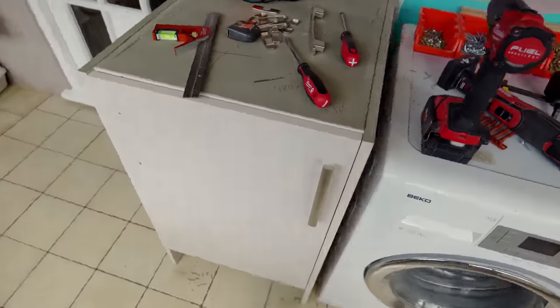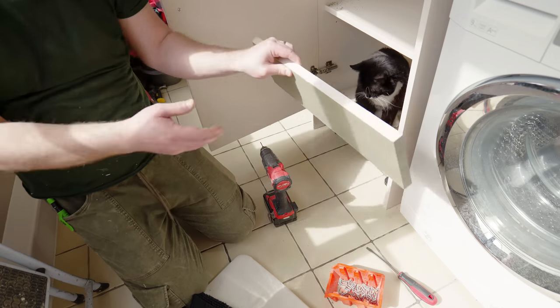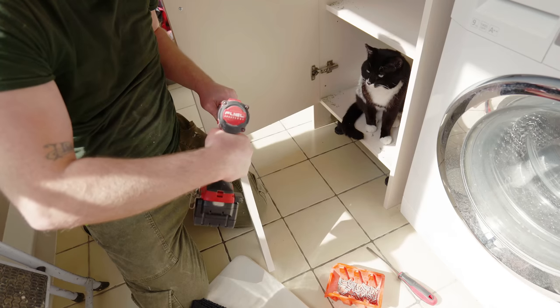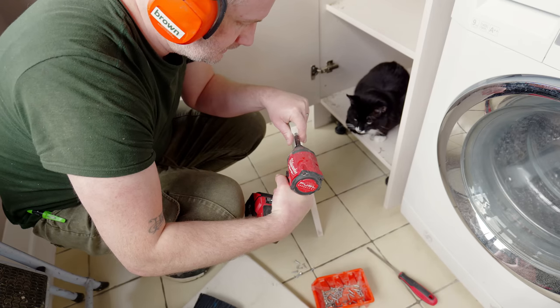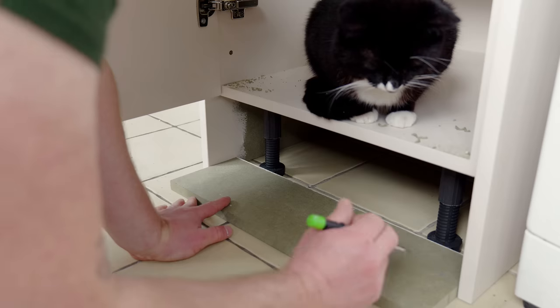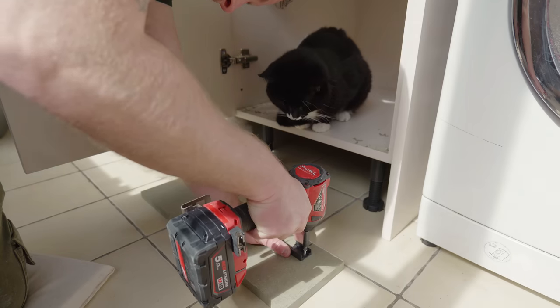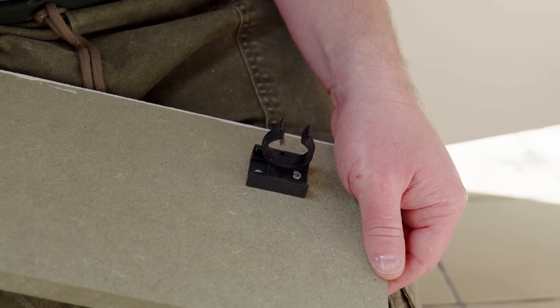I also made a really stupid mistake — I drilled out one handle on this side incorrectly, so now I've got some holes to fill and paint. These are the plinths I made, and I primed and painted the bottom edges just to protect them from moisture. I'm also going to drill some pilot holes and add a couple of small screws to act as feet to lift the plinths off the floor by a few millimetres, so when the floor gets mopped we don't need to worry about the MDF swelling. I marked up where the centres of the legs are — the clips came in the box with the legs, I'll leave a link in the description too.